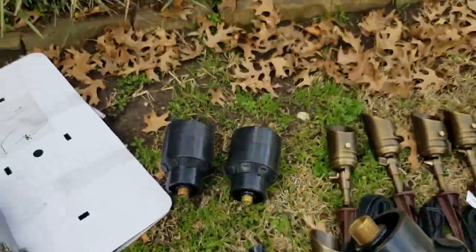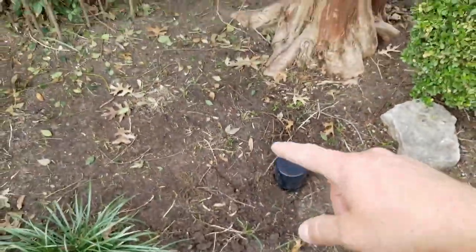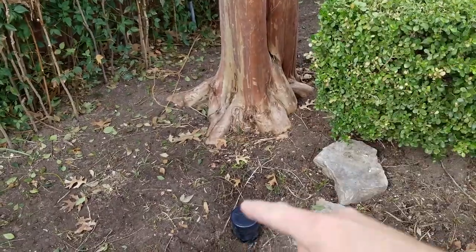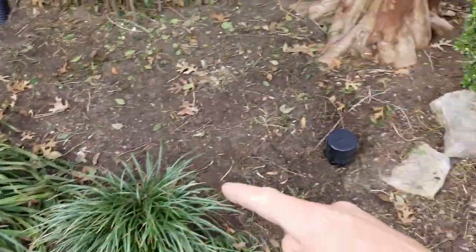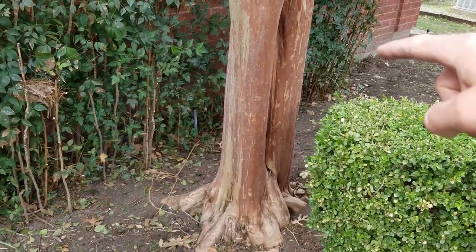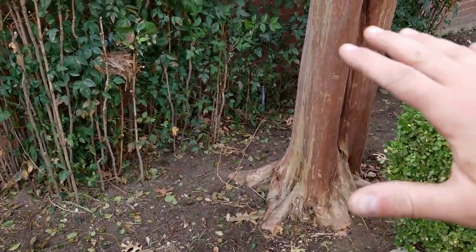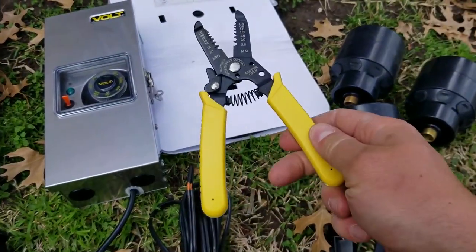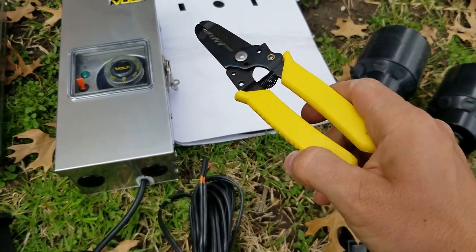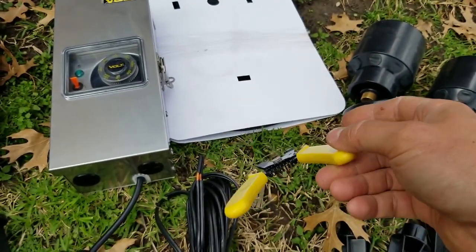I'll give you an example. If we put a hub here with a stake, instead of wire just being along the house, we're going to have wire coming this way, that way, and from the trees and the path lights — so you have wires literally everywhere in the flower bed. Instead, I like to run my main wire and connect it to the light, doing a daisy chain so the lights and the wires are completely out of the way against the wall. It also comes with wire strippers. At first I thought it was really cool that they included these, but they suck — after you use them a little bit they might just last one install. I've ended up throwing them away because they're really just a one-time use.